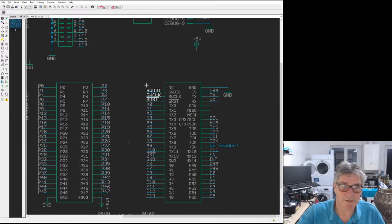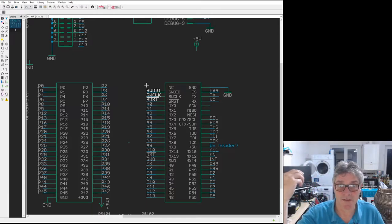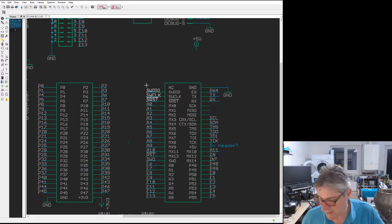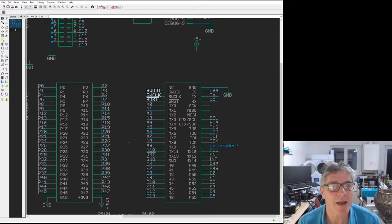And you can connect something as simple as one of these. I've got a bunch of these. If anyone needs one, let me know, I can send you one out. Not the same as this one, but a low-cost Chinese, Asian knockoff ST-Link. So from an Ice Core point of view, it's easy, because that's all you need to drive. You don't have a JTAG on the Lattice Ice range.